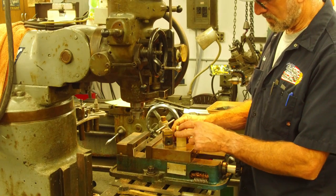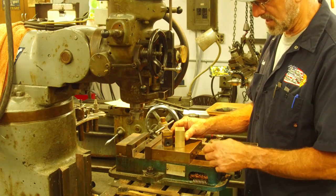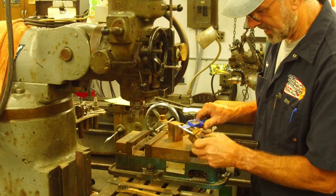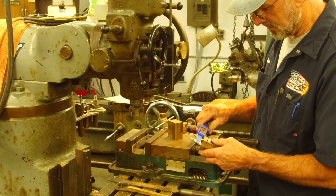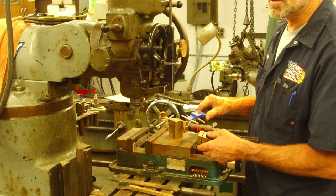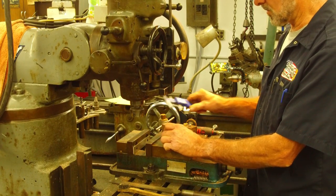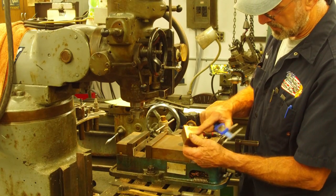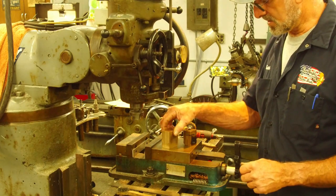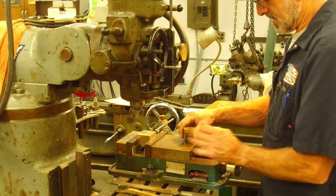Well, we're going to be turning or machining this. We're going to be milling this. We'll turn the other nut and then do milling. This diameter, this width right here, is 5 thousandths under 1 1/4. Right now, this is about 1.338 or so. This is extruded bronze. That surfaces the extruded thickness. And we're going to machine that down till we get to that width right there.